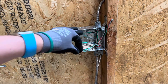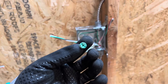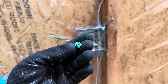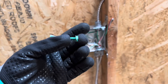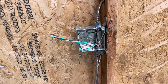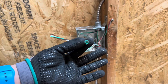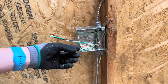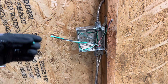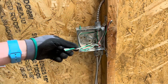Today I'm going to show you how to ground a box. With a normal plastic box you don't have to, but with metal boxes you do. This is a ground screw. There are different ways to do it: a ground screw with no pigtails, one pigtail with a ground screw, two pigtails, or three pigtails. Normally one pigtail goes to your wire nut, a second one goes to the device, and if you have two devices it goes to the second device. You basically pick the pigtail configuration based on how many devices are going inside your box.